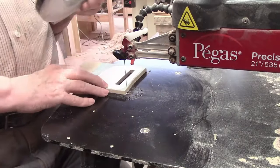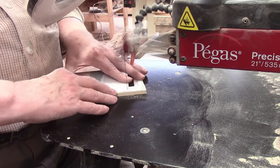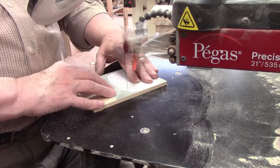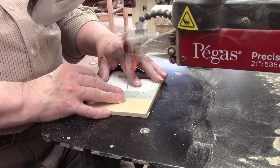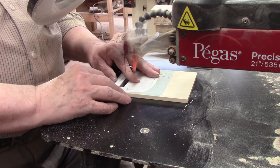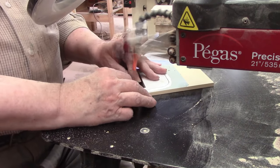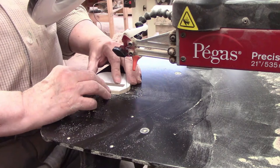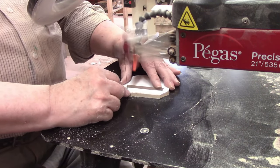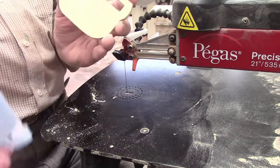The outside cut for the eraser shape is about as easy as it gets. I always like to start outside cuts either at a corner or at an angle when I can, and that option was available here. There were a couple of sharp turns but they were no more difficult than the interior cuts already made. I cut all the way around the perimeter, and when I approached the 90-degree turn at the top, I just kept going to the edge of the workpiece — that way I could start at the edge and make a cut straight across the end. I always try to think and plan ahead to make every cut in the simplest way possible.